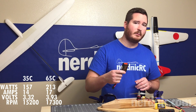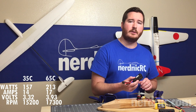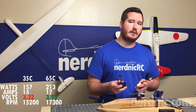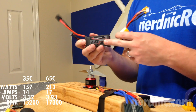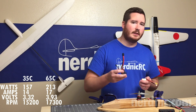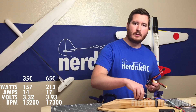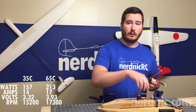Okay guys, so straight off the gate, the 65C battery definitely performed better. One thing that was apparent is that under load, the cells held a higher voltage compared to the 35C battery — about 3.93V on the 65C and only 3.32V on the 35C. That's a pretty big difference. Your battery can only deliver 4.2 volts on a fully charged cell, but as soon as you apply load, the cells drop to try to keep up with demand. Every bit that it drops reduces the total volts going out, and lower voltage going into the motor means it's going to spin slower — because the way KV operates, RPM equals voltage times the KV of the motor. So if your voltage goes down, your RPM goes down.